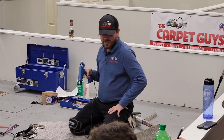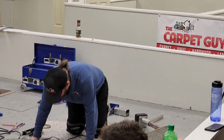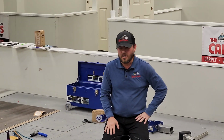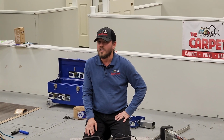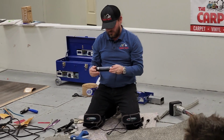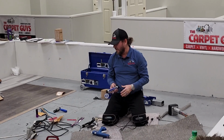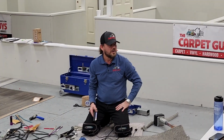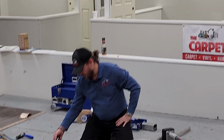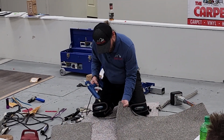The inspectors, they like to have a field day every time they come into a carpet installation, and there's an issue with any type of the carpet or the installation. The first thing they will do is shine that UV tracer light on it to make sure that you guys put it on there. So let's try not to give them any ammunition to deny the claim and blame it on the installer. So make sure you always use the acrylic or the Peak Buster glue gun to seal your seams.